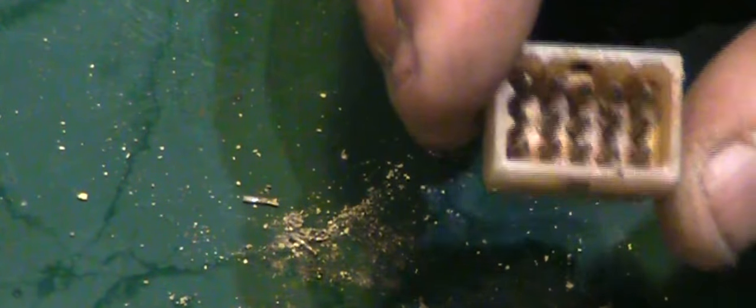What I'm hoping we can do is push these pins out from the inside in there and either repair them with a little piece of wire and put a new pin on the end, or indeed I might even have some of these pins somewhere, either in another connector or in a bag of pins, and be able to just replace them outright. In fact, what I'll do now, because this is absolutely filthy, I'll go and get my ultrasonic cleaner and we will throw this, I might just whip that DIN connector off as well, and we will throw these in the ultrasonic cleaner and see what we can do with them. So back in a sec.